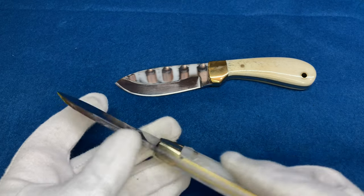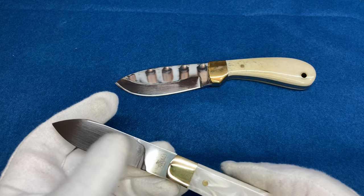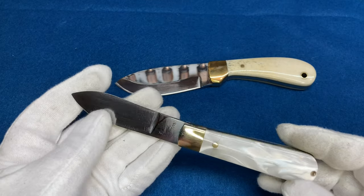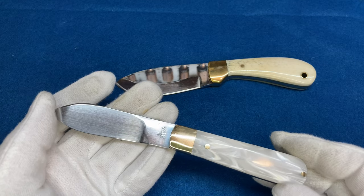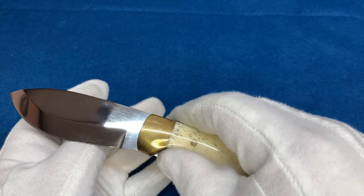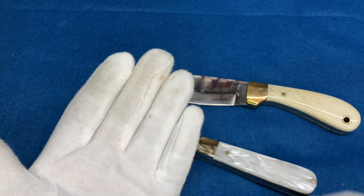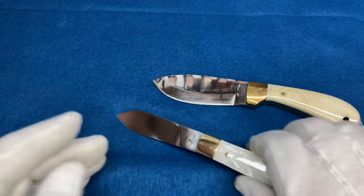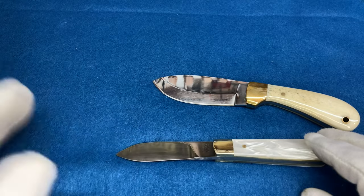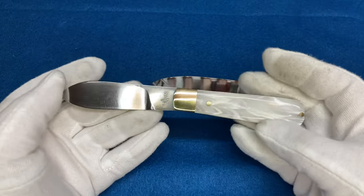But yeah, it would jump. This is me. It jumped and everything. And here I tried to do it this way and then this way. And then I figured I'll just beat it all up and make it rough, but then I polished it anyway. So I don't know what I'm doing. My plan is to eventually get a really decent grinder. Also, you can see my swedge here is horrible as opposed to like this. The backing where the belt runs is canted, and I didn't notice it until it was too late, and I couldn't put a straight line in the beginning of the bevel, I guess it would be. So whoops, like I said, another mistake that was made.